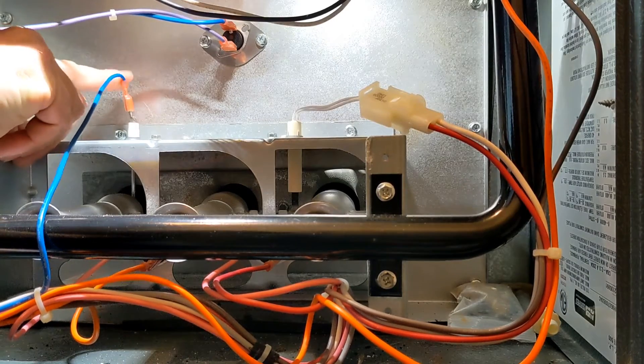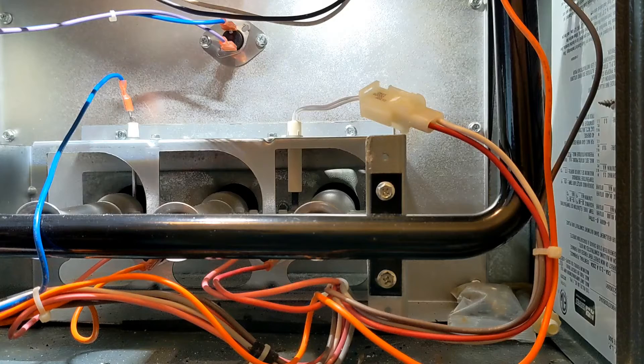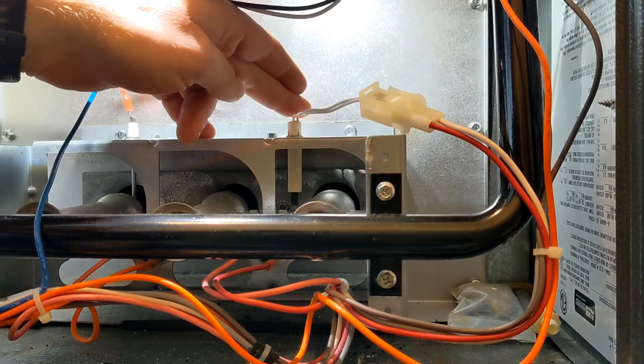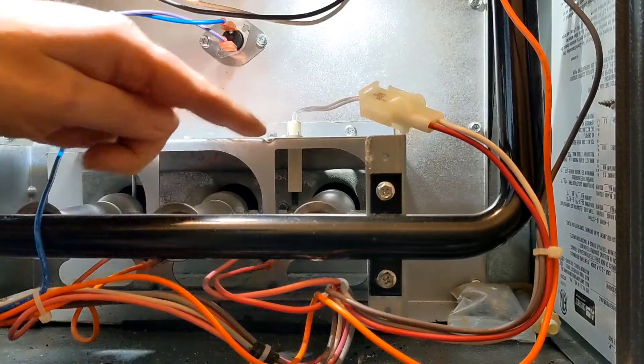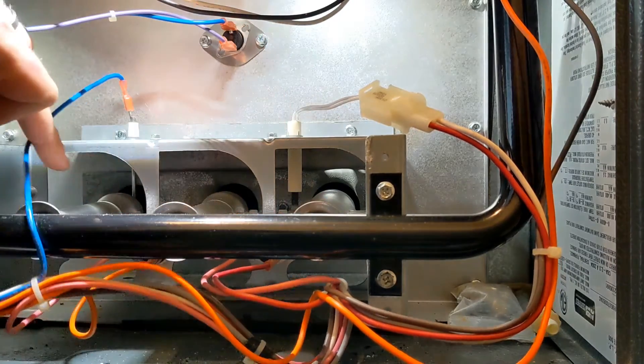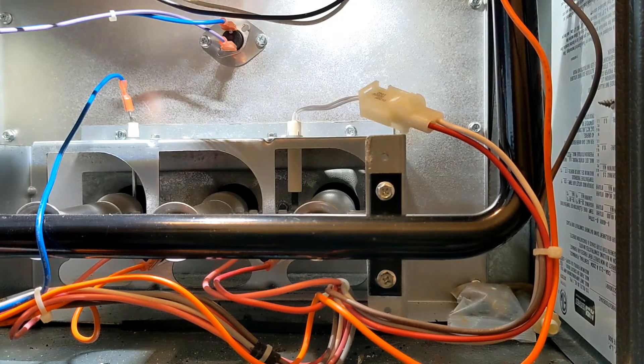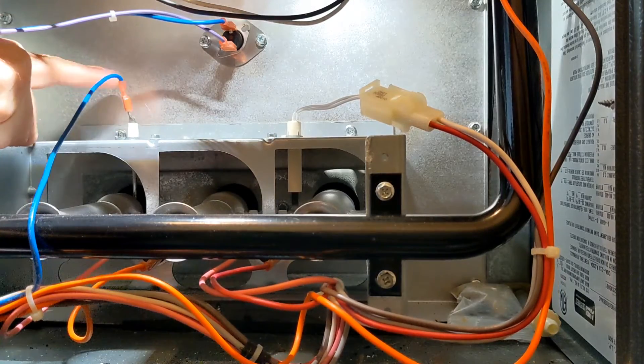In this case, the flame sensor sits right here. The screw is already loosened up — I'm not trying to cheat you, I just loosened it ahead of time to make the video easier. On one side you've got your HSI, or hot surface igniter — that's your igniter that actually lights those burners. This would be your number one burner, this is your number three burner, that'd be your last one. So that igniter lights that first burner, the flame runs all the way across, and once it gets to the last burner, the flame sensor has to prove that the flame is on and the gas valve can stay open — everything's safe. You are going to need a nut driver or a screwdriver to get that screw out that holds it on there.